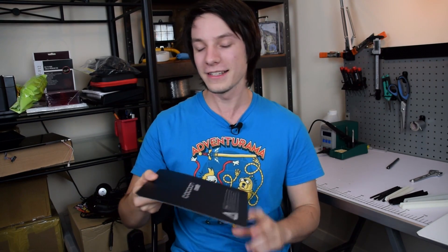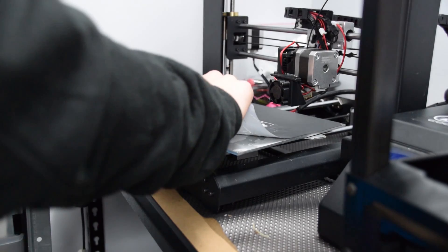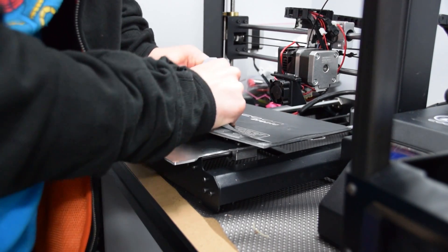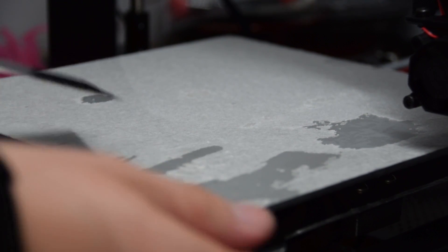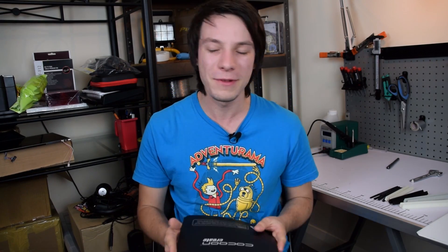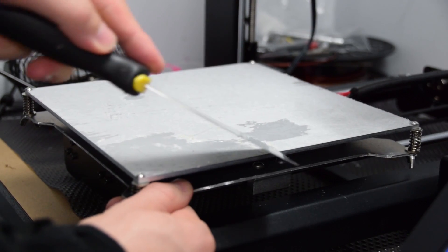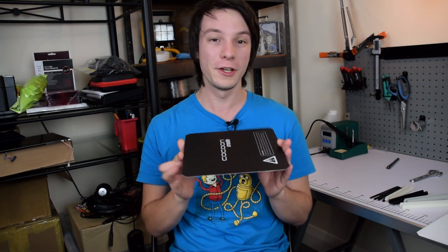The next step was removing the stock surface, which was nightmarish. It's an adhesive-back surface, similar to BuildTak, and when I peeled it off the surface pulled away from the adhesive rather than the adhesive pulling away from the aluminium. That left the bed covered in sticky, disgusting adhesive I couldn't get off without gumming up the scraper. I tried cold, I tried hot — I heated the bed to 60 degrees and it just gummed up the scraper more. That's a big negative if you ever want to change these plates, and this thin 0.6–0.8mm surface is quite easy to damage with a scraper.